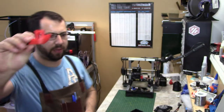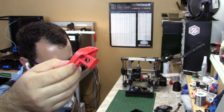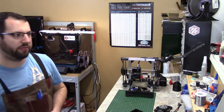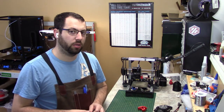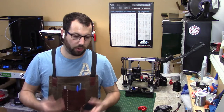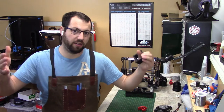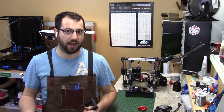And this is a 12 minute Benchy, but it's done with a 0.8 millimeter nozzle. Okay? If you want to print fast, you go with a bigger nozzle. You don't print faster. Now, the ability to go faster does a lot of things for you, because if you can do every travel move at 300 millimeters a second or faster with 7,000 acceleration, and you're printing a whole plate of parts, all those little travel moves and time savings add up.